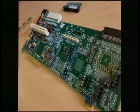But it's got an FPGA on it, and as was mentioned in some of the previous talks, FPGAs are very cool. You can reprogram this to do all sorts of things, but they're also really good if you've got a board and you don't know the connections to it. Well, they're malleable. You can program what the connections are. So as long as you find them as inputs, and this is what I did, using the wire and the clip and some JTAG software, I set all the pins to inputs and probed around on the board. So I found a lot, maybe over 100 pins this way. And because they're malleable and you can program them, you can do what you want with them as outputs. And you can do fairly high speed things.